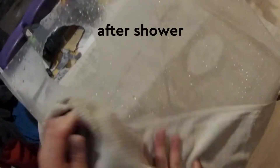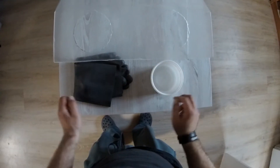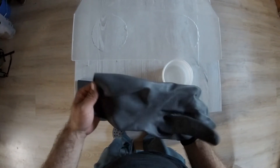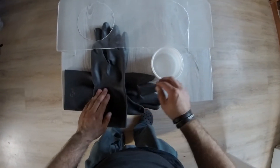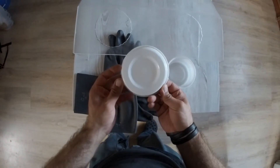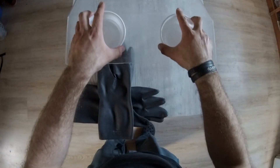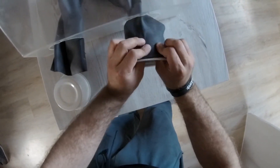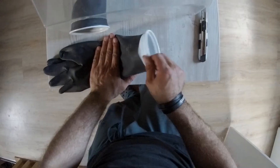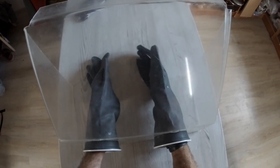After that we will need to wash our acrylic with soap. Now all that remains is to fix the gloves — this is the glove box after all. For this purpose we used butyl rubber gloves, which are used to deal with chemicals and are relatively inexpensive. You can make the adapters out of any tupperware you have around. We will cut the bottom away from the vessel, insert it into the glove and glue everything nicely. Then we will install our box into the enclosure or secret spot of your preference.